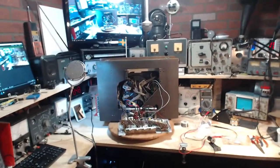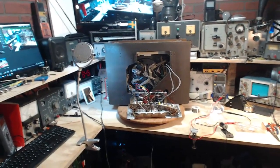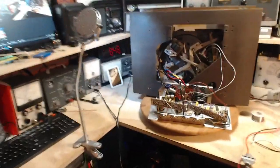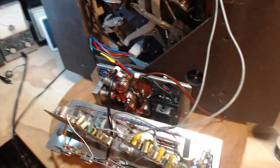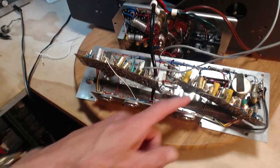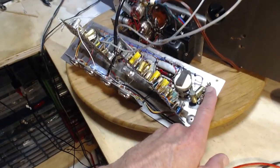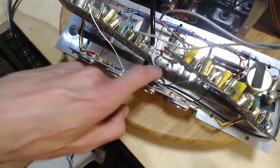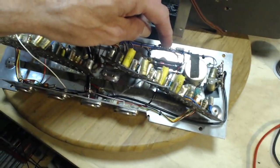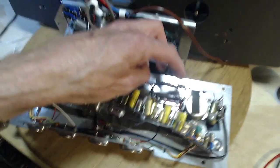Hi, thanks for joining me in my shop. I'm going to be putting this record player back together and getting it ready to be shipped out. In order to do that I had to undo a few of the temporary things from the testing phase. I've taken out the two temporary ground wires that I'd soldered onto the back of these two boards and I've installed a permanent ground wire from this terminal. I've also installed permanent fixed resistors here - I've taken out the far too large and unnecessary five-watt resistor I had in here just temporarily.